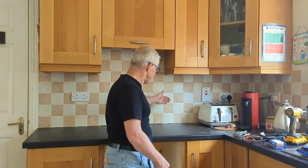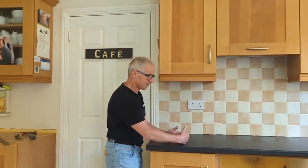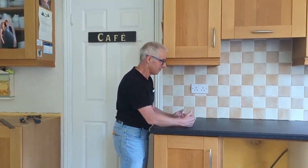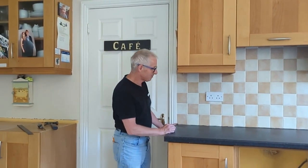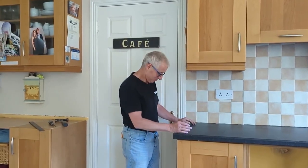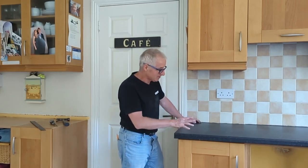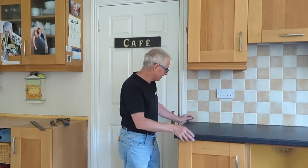The wall is running outward this way from that point, so in other words we're off square — we're a little bit less than 90 degrees. That means I've got to alter the top of this point. It's a bit of a nuisance, you'd be hoping they'd fall sweetly for you, that it would just sit in nicely. But Murphy's Law — something can go wrong, it will go wrong. It's not a fault, it's just the way the wall is.